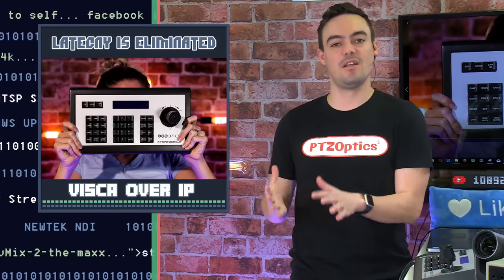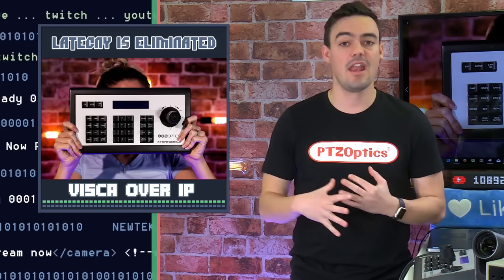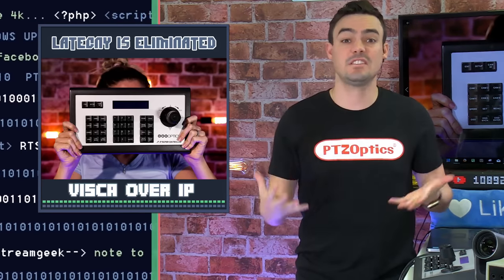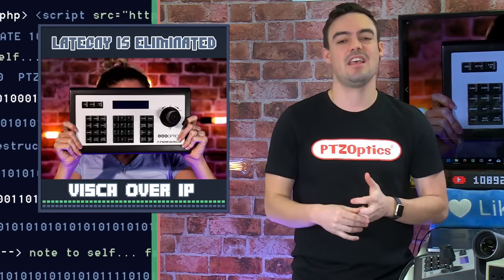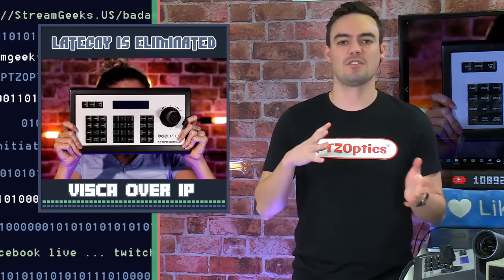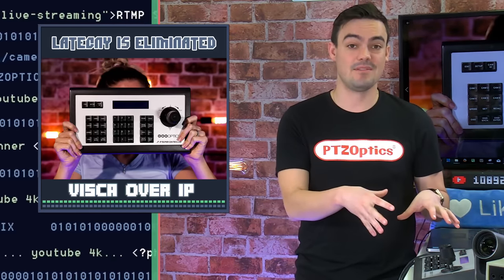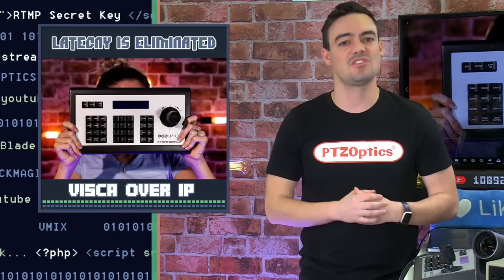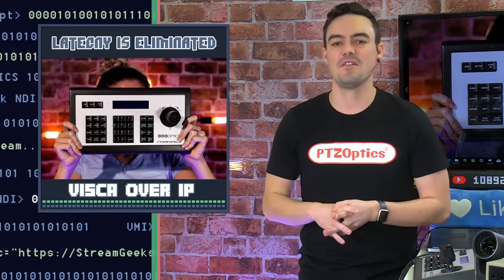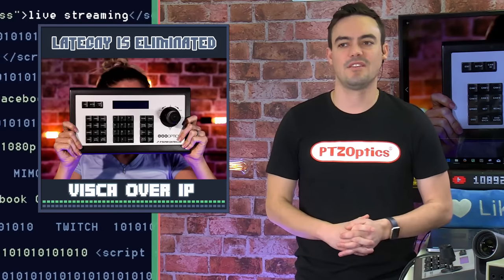The big deal is the Gen 1s and Gen 2s relied on a protocol called VISCA. It worked and it was good, but it really wasn't ever designed for high-end video production. VISCA over IP is. It will allow us to switch quickly between cameras, get really great responsive controls — pan, tilt, and zoom all at the same time. Plus, if we have time today, we'll go over great new features like one-button hold to set presets. You don't even have to go into the IP interface to assign presets to cameras.